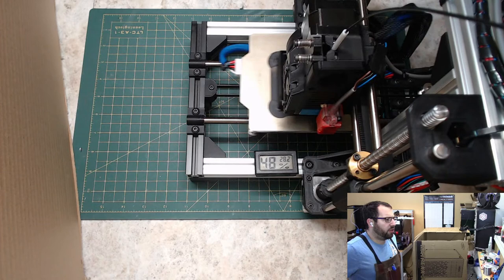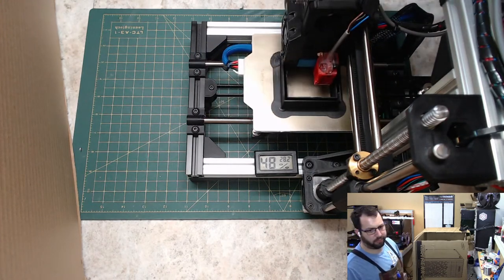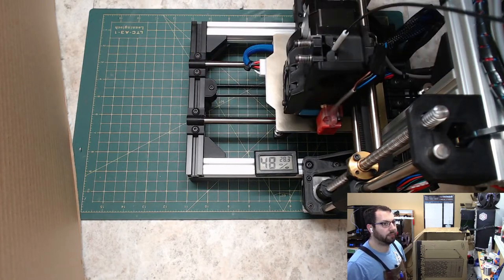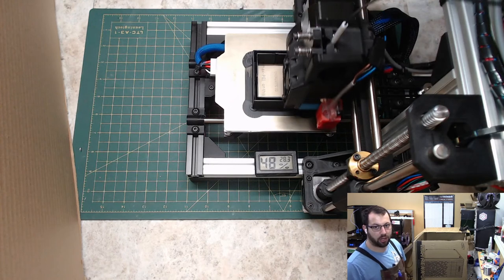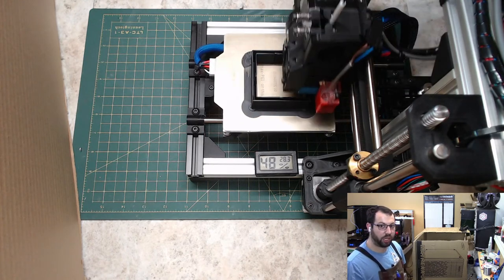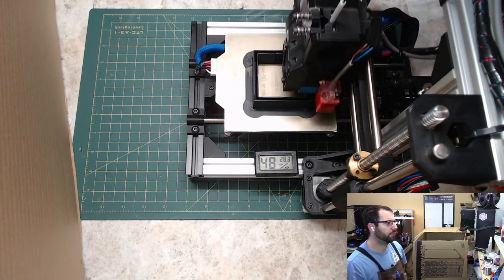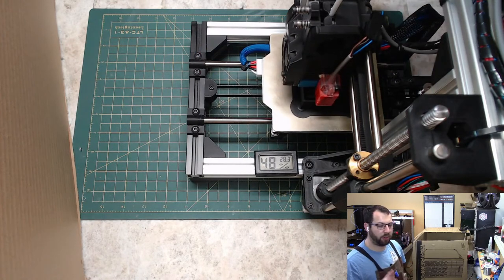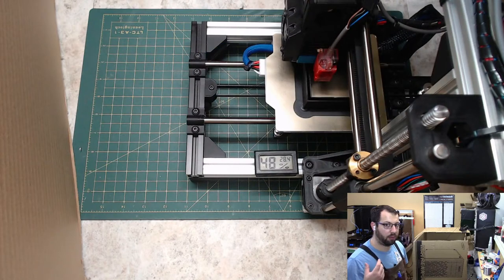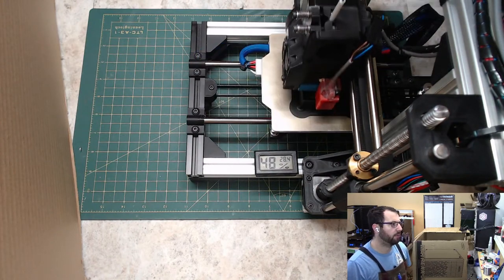Hemera alternatives. What do you suggest for very flexible filaments? A good hot end: E3D V6, Triangle Labs V6, Dragon, Triangle Labs Dragon, Phaetus Dragon, Mosquito. And then slap a BMG clone or legit on top of it. All you really need to do is have a constrained filament path. The shorter, the better. And print slow and minimize retractions and go from there, and you can print flexibles.